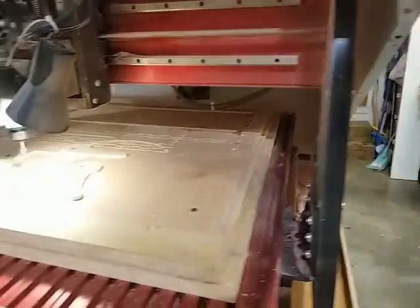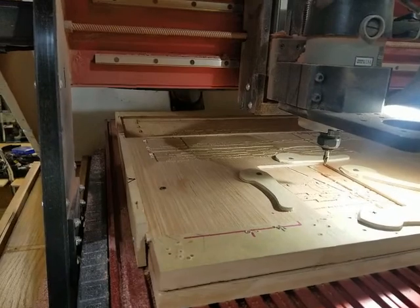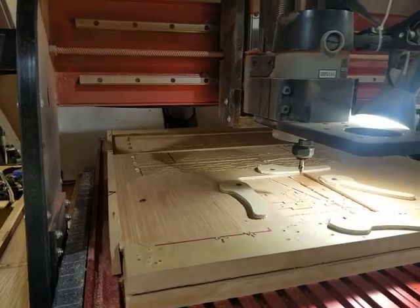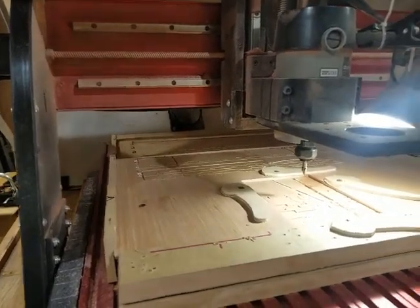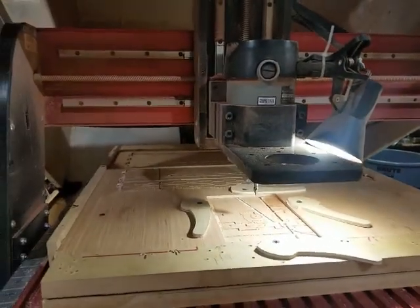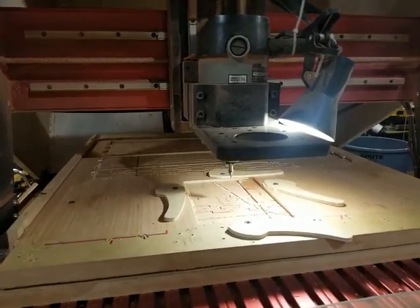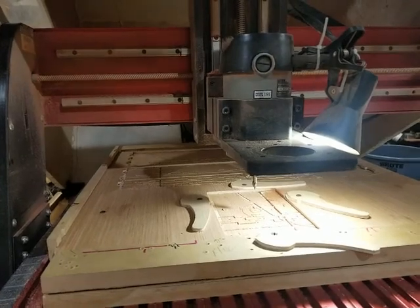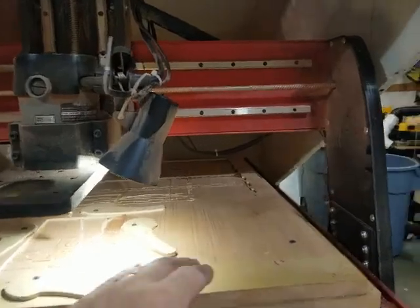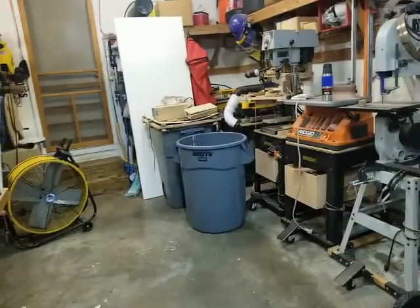You can't hardly beat a jig that you can just put a screw down into the tabletop. I've been doing woodworking for a long time — 35, 40 years — and you just can't beat a wooden table for being configurable. You can just screw down whatever it is. I don't use tape, double-sided tape, or CA glue — I have it available, I just never use it. I always jig things up because every time I have an issue it's when something comes loose.